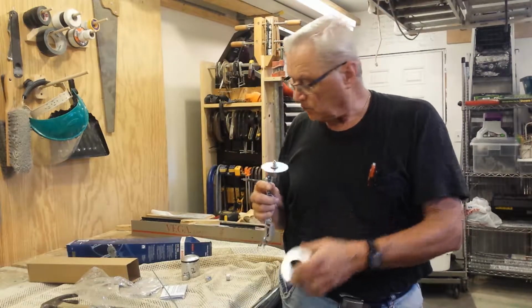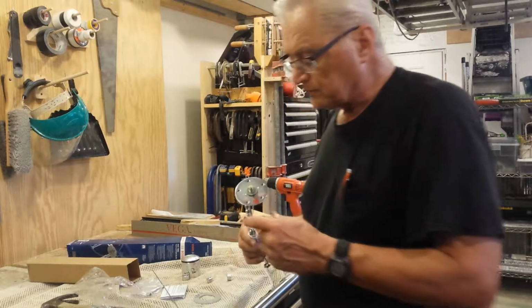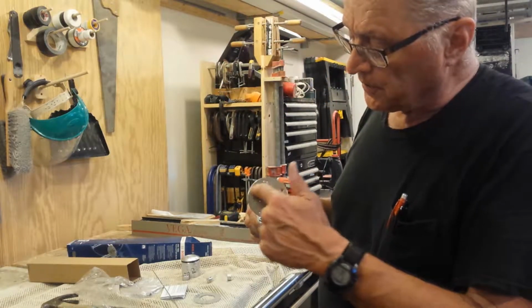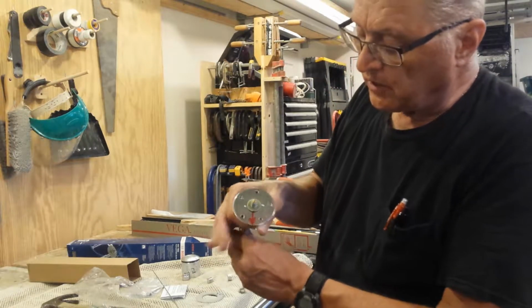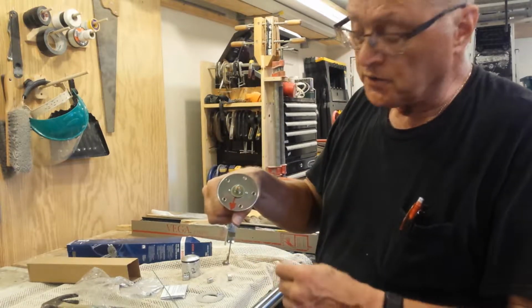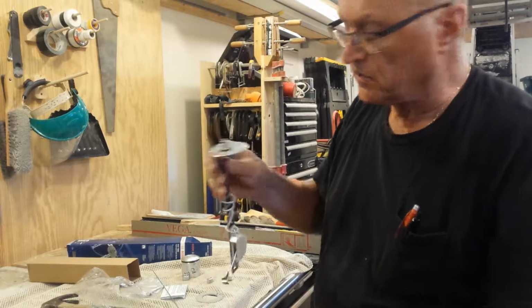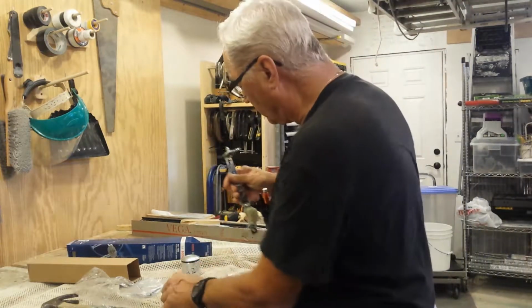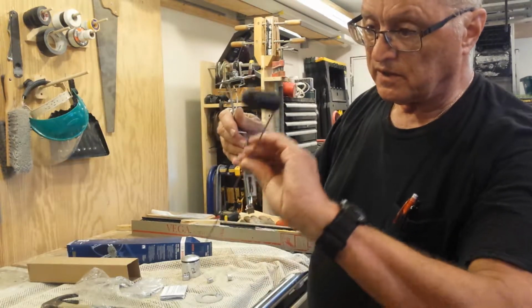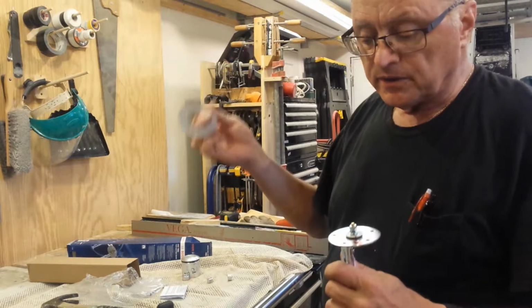One comment on that, because I didn't record any of this. You may know this, but this 5-hole pattern, the holes are not spaced evenly. Once you put it on the ring and use a transfer punch and mark all the holes, it only goes one way. You can't clock it and put it in a different direction. It's just a one-way fit. So you want to make sure that it's sitting in the right direction in the tank for the float to work. And this was just welded on, drilled and tapped.